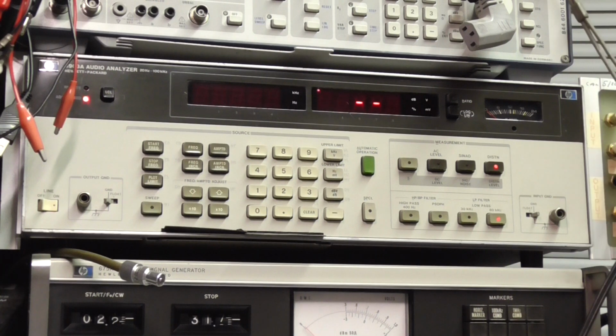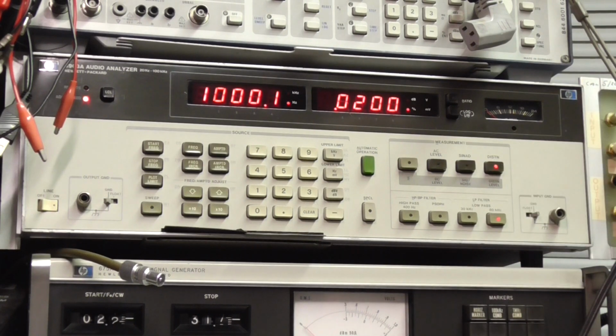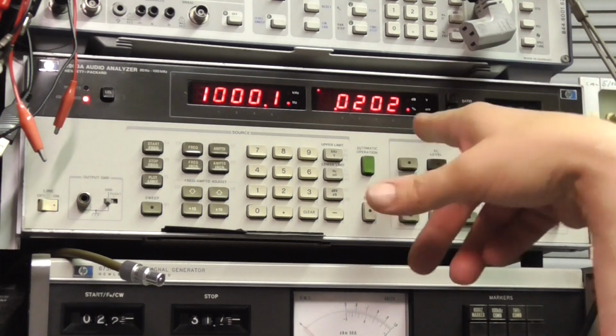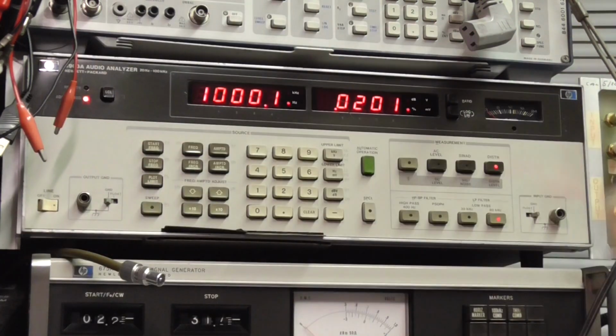Oh, I'll just activate the protection circuitry, and that's probably because there's the audio analyzer's ground. Yeah, so that proves the electronic protection circuitry works. You have to be a little bit careful doing stuff like this, because if anything's ground, you're basically putting a short on the output stage. Luckily we're not driving the amplifier hard, but obviously the protection circuitry works because it's detected a massive spike in current and dropped the output stage out to save the output stage.